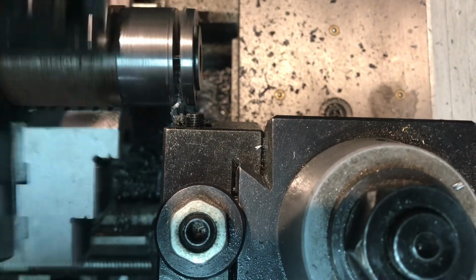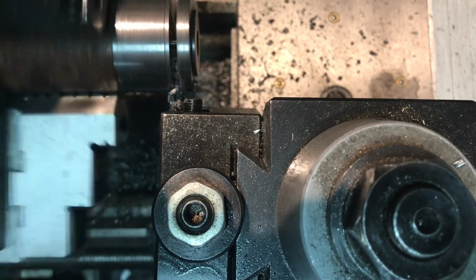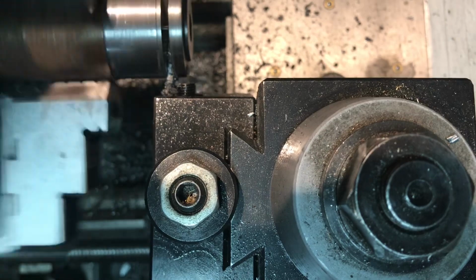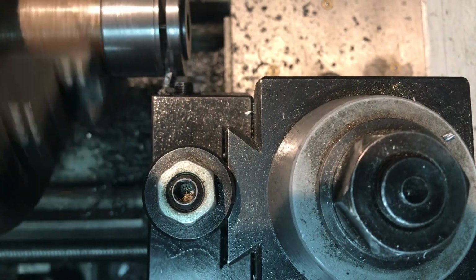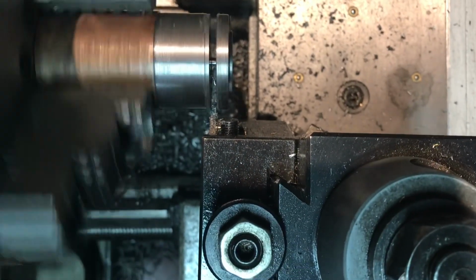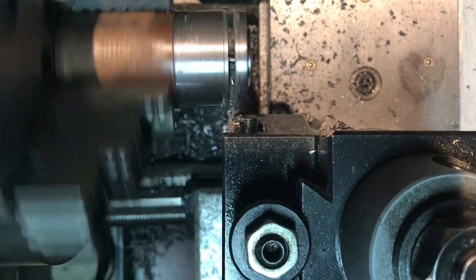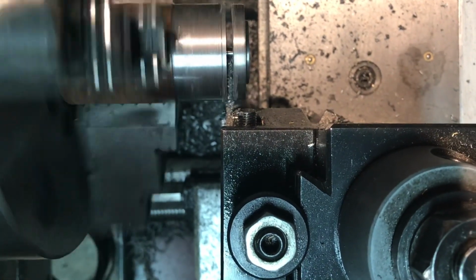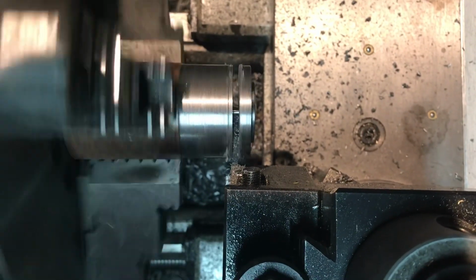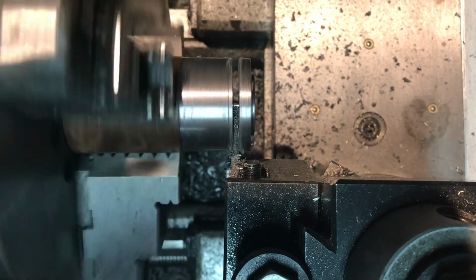And it just has a little bit more to go. What I've been doing is withdrawing the tool, brushing off all the chips, and putting a fresh coat of oil on it as well. Sorry, my camera work is not great. I'm holding the iPhone over the lathe, but someday I'll get a real nice professional setup like A-Bomb or Maddie's Workshop has got.